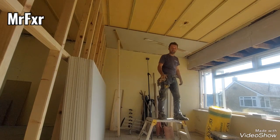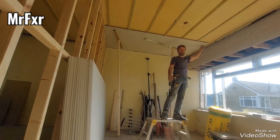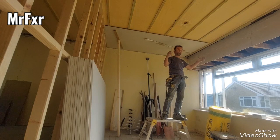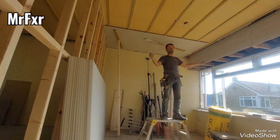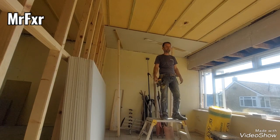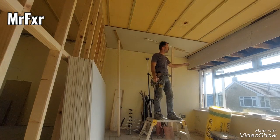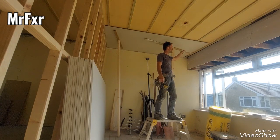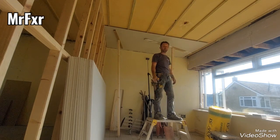another piece into it. By doing that, I'm having an extra support there on that joint. I'm just literally putting in an offcut of batten, which is much, much cheaper than a tenth of a sheet of plasterboard. One sheet of plasterboard is £10, 1 meter of 19 by 38 batten is about 50p. So having a few bits of batten there, you don't even have to have a continuous batten. You can have, say, 3 small pieces or whatever offcuts you have. You can utilize all the offcuts from these battens into fixing joints of the plasterboard.